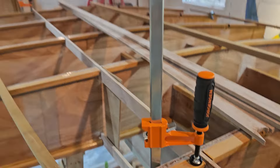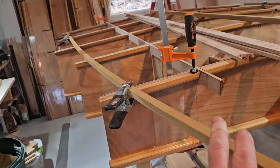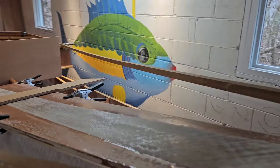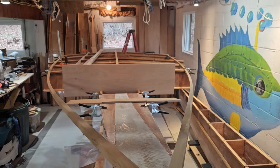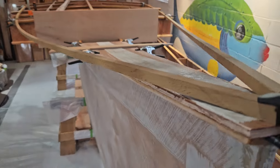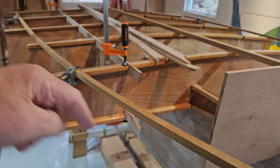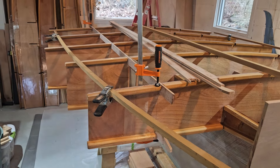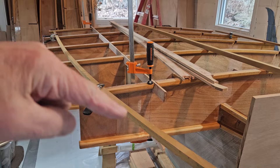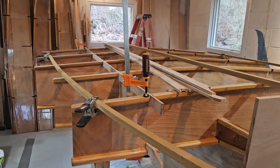I've been playing around with the curve of the deck, just putting a couple of battens on there to see what it might look like. I'll probably put the bottom plywood on first, then the deck plywood, and then cut everything. Once I put the two hull halves together — even just temporarily — I'll line the whole thing up and cut it all at one shot so it's all nice, straight, and a fair curve. At least that's the current plan.